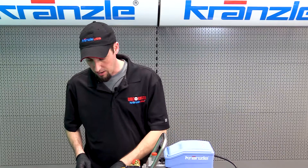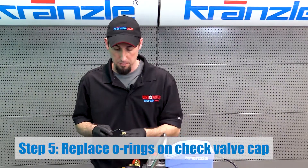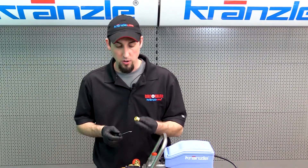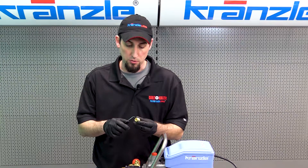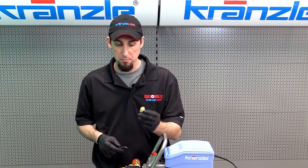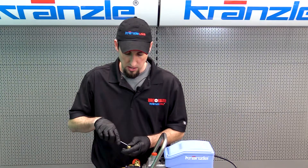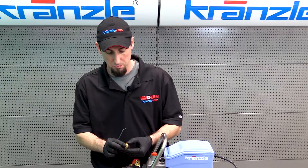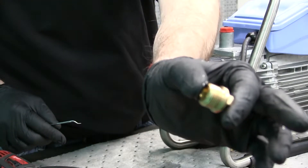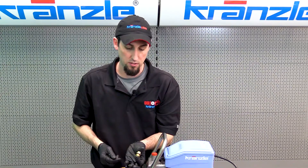We're going to reinstall the kit and I'll show you how to do one of them right now. Along with installing the new check valve, you'll take the old o-ring off the valve cap. You may find some Loctite on these threads as well as oxidation, so this is a good time to hit them with a wire brush — don't hold them under a wire wheel too long or you'll wash away the brass. To reinstall the o-ring, I set it on the valve cap and use a pick to walk the o-ring around and slide it down onto the cap.